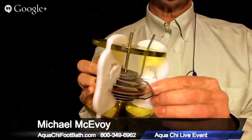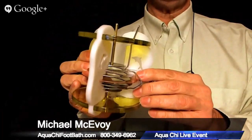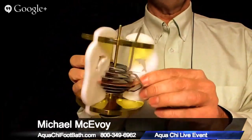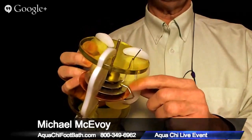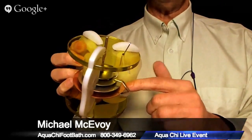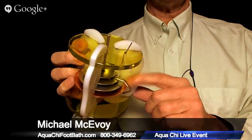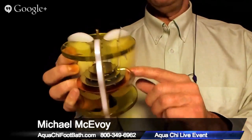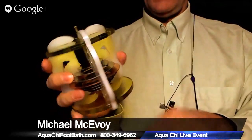Let's say we have something a little more. What we want to do now is to change the copper ring. Let's assume that you've had your module for 3 years. You've been changing your ring sets. You've been taking care of things. But now you find that this copper ring is deteriorating. Now, this is a brand new module, but let's use your imagination. If that was the case, this copper ring would be getting thinner and thinner and thinner. And that's when you know you've got to change it. So what we're going to do is change the copper ring.